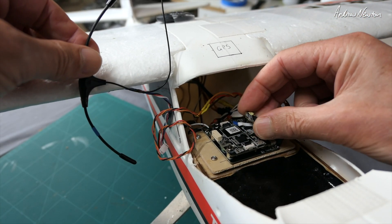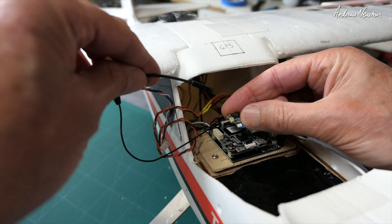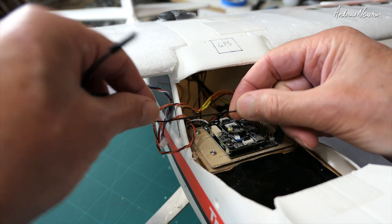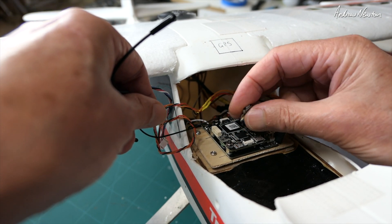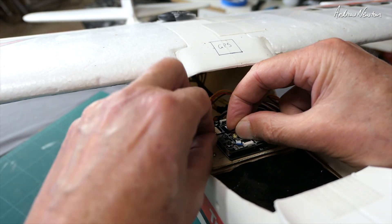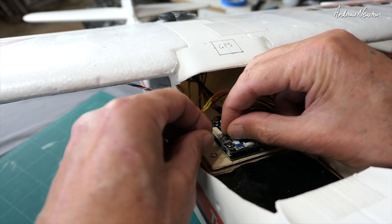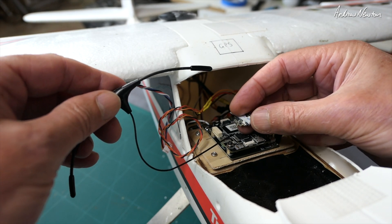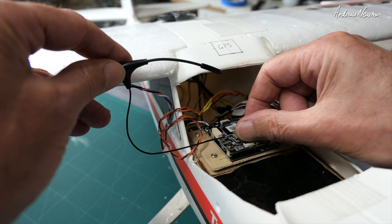I'm editing this bit in later — I've actually taken the little R9 FC receiver out because the antenna broke off. That's the problem with having the receiver fixed on board: the antenna has to be positioned somewhere nearby and you're always going to be flexing that joint. I would actually prefer not to have an onboard receiver and instead position the receiver and antenna wherever I want and secure it nicely. If you're using this, you really have to make sure you've got some strain relief on the antenna wire so that joint doesn't flex like crazy. It happened after I recorded the FPV part of this video — the antenna broke on a landing.